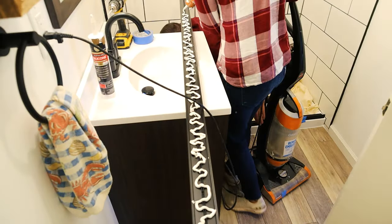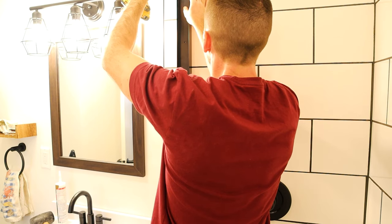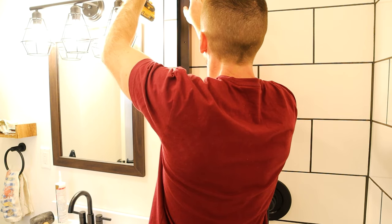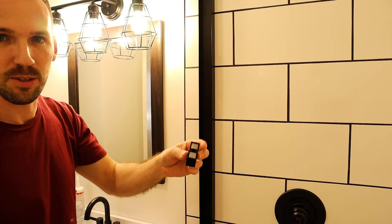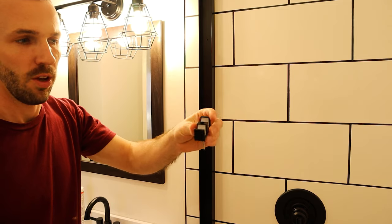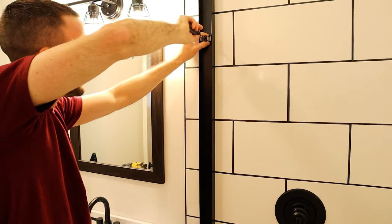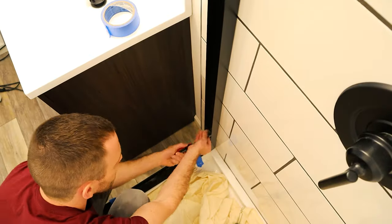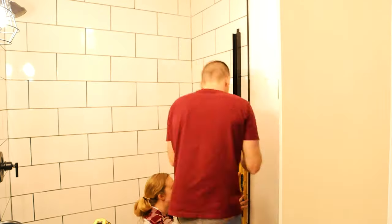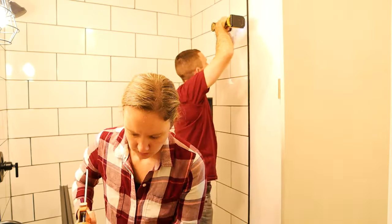Now here we go again with the overkill and the caulking, but we really want this thing to stay. The glass doors are quite heavy — this whole package was about 200 pounds. Then for the rail you use the pan head screws, which are more of the flat screws with this little bracket here. There are two brackets for each side wall to install, and you'll need to tap in sheetrock anchors into the pre-drilled holes — those are included with the shower door. Then I repeat it for the other side of the wall.